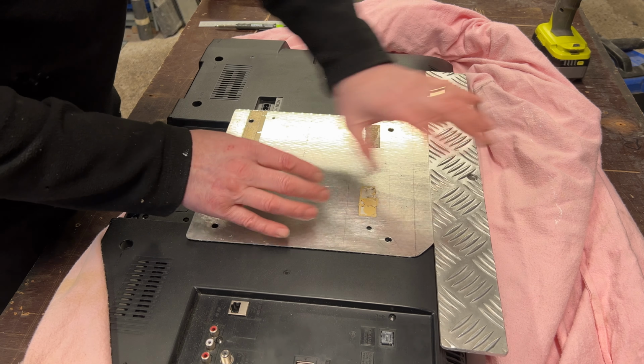But because I want to put a frame on the top of this, or lip, this is already radiused. Now that's not going to be any good if I'm going to put a strip of wood on the top. So what I've got to do is just shave the minimum amount off these pieces of wood in the table saw there. Then we can do a few mitre joints.